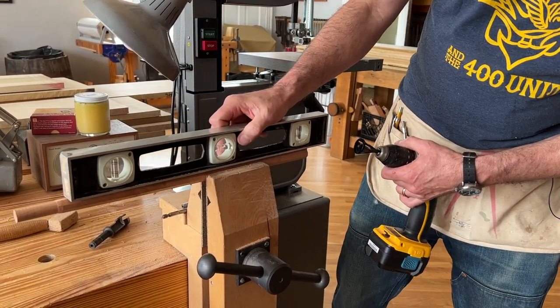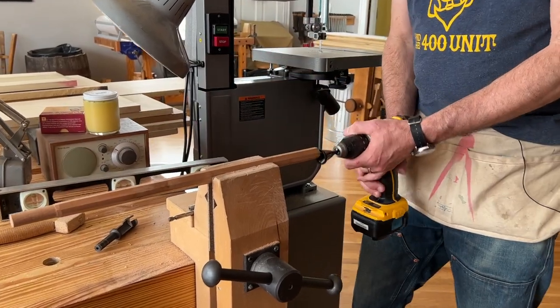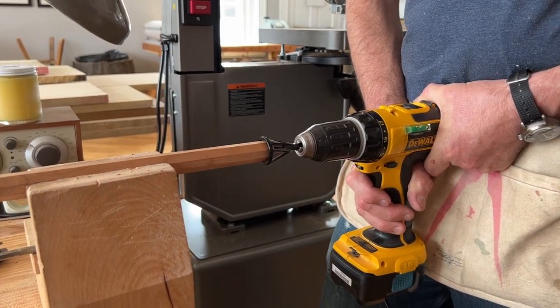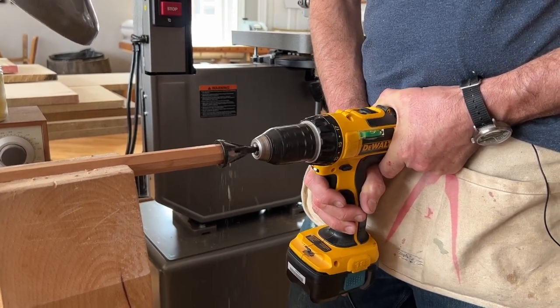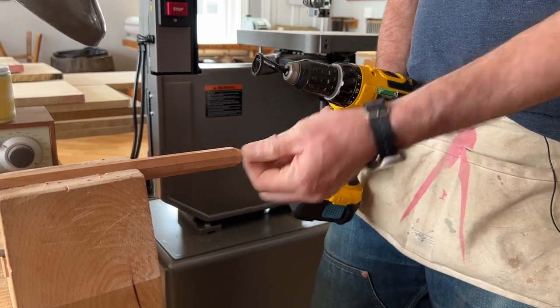First I'm going to make sure that the stick is level in the vise. Then I'm going to use the chamfer deburring tool — I'll level this even though it doesn't make a huge difference at this stage. I just want a little point. I don't need a pencil point, but I can tilt it and correct it and get it perfectly centered.